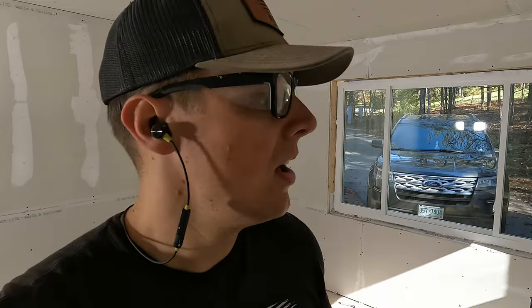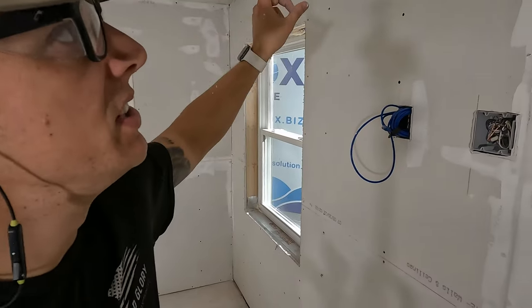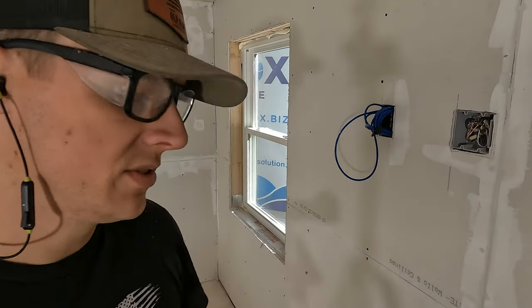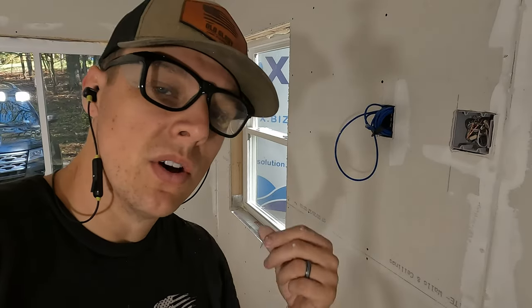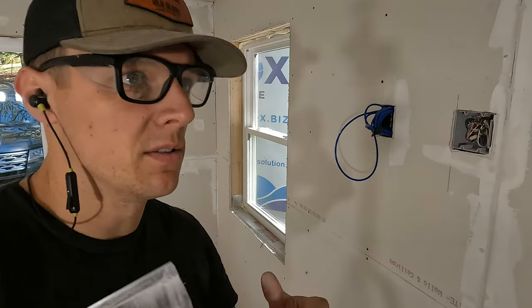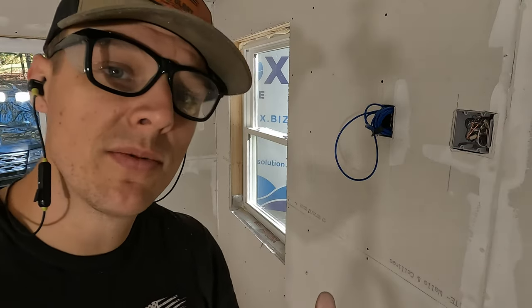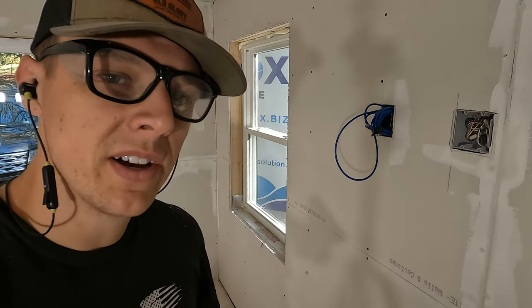All right, so I just put all of the fiber tape on all of our gaps and gonna hit it. I haven't done the corners yet, obviously. You need some mud in there before you use paper. So we're gonna use Perfect 90 on that. It's a little bit better, supposedly stronger and faster and easier. I've never used it before. I usually use paper, but paper sucks.